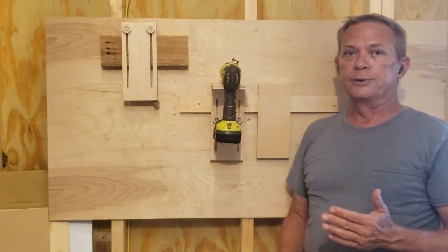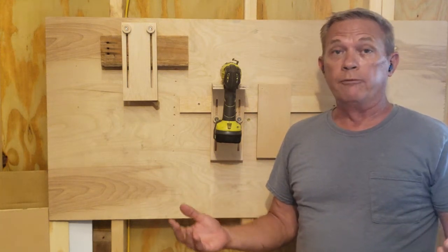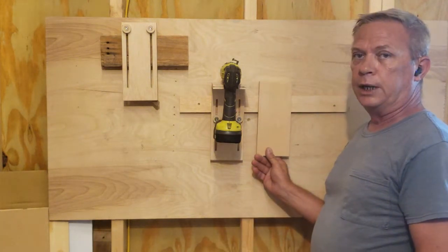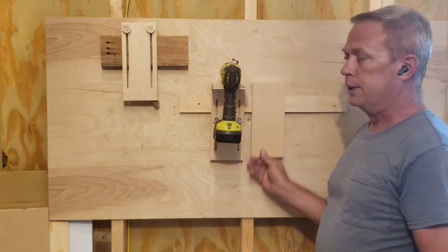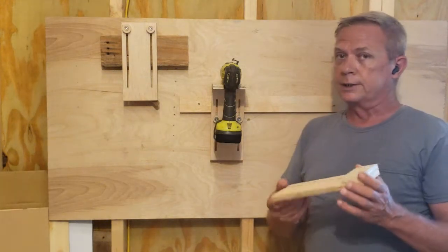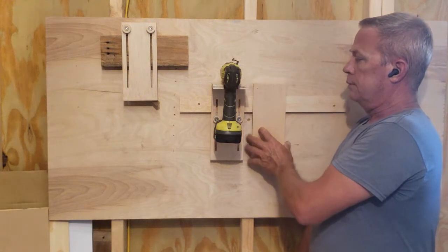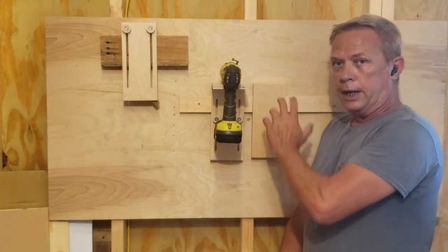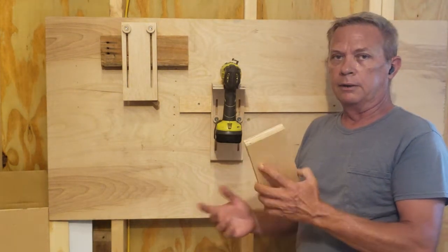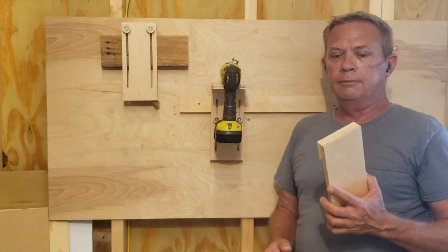What's wrong with French cleats? Nothing — and that's something I never thought I would say. There's absolutely nothing wrong with French cleats doing exactly what they're supposed to do. It's like saying there's something wrong with my truck because it won't fly — it's not an airplane. This is not meant to keep things from coming up, it's meant to keep things from falling down, and it does that quite well. Most of your breakage comes when it angles, but take a little off the top and that'll take care of a lot of that.